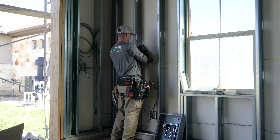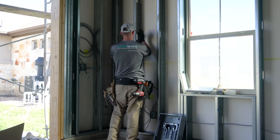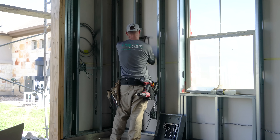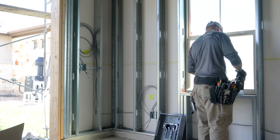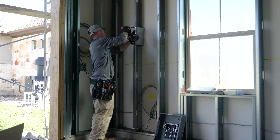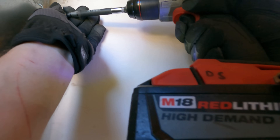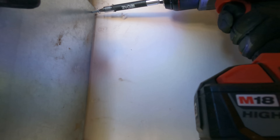To get the panel installed, these are metal studs shaped like a C. They don't usually flip them back-to-back for electrical panels unless you're cool with the framer and ask them to flip those back to back so you have two flat surfaces to screw the panel to. They didn't do that here, so I had to cap one side of them and put some sheet metal on it so I had a flat surface to screw my panel to on both sides.